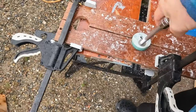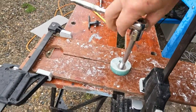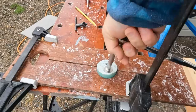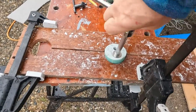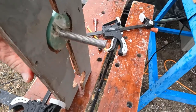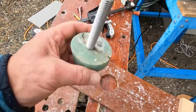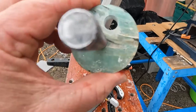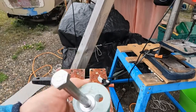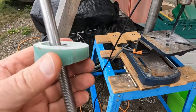The bolt is screwing down through the FR4, coming out the other side. What would it be like when it reaches the shoulder — where it goes from threaded to smooth? That is very tight. Is there an issue to do with heat expansion? Presumably the FR4 and the stainless steel will expand at different rates when it gets hot. So clearly what I'd love is a 12.7 millimetre drill. But you can see the washer is sitting beautifully flat in there — so that's a triumph.